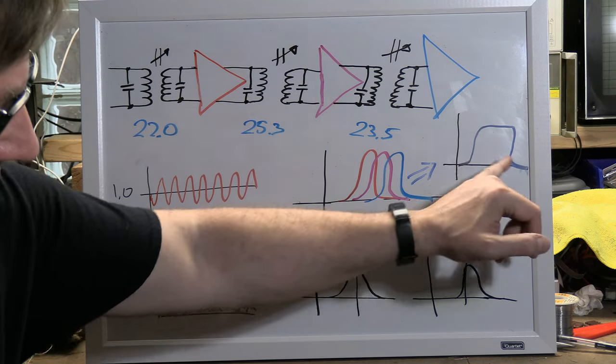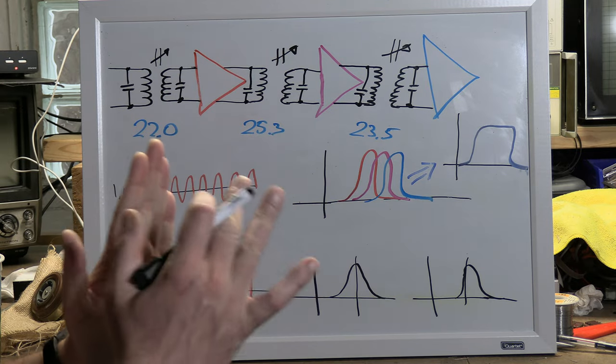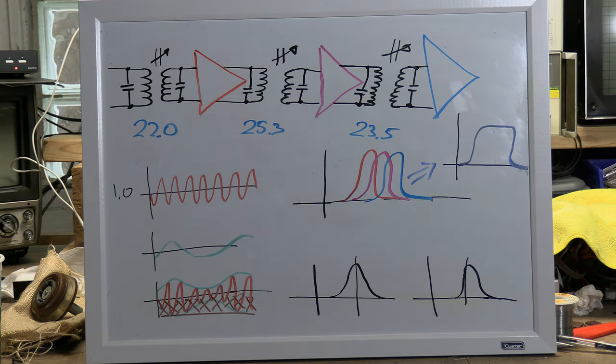Well, they already had all these standards defined about how much bandwidth they're going to allocate to a TV channel, and they'd already assigned the stations and built their transmitters and all that, so they weren't going to change the standard bandwidth allocation, which was about 6 megahertz per channel. So what did they do? They decided to sacrifice image quality to add color information.